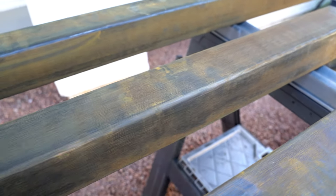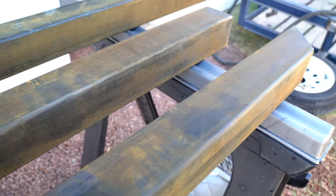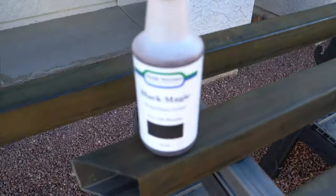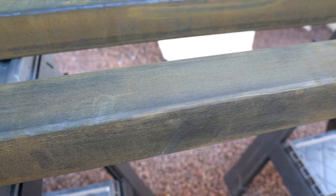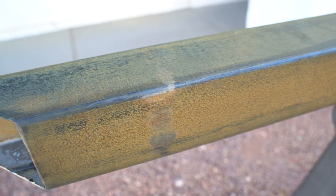The frame pieces are done drying in the sun and I am not happy with the finish at all. And let me be clear — I think the product is doing what it's supposed to be doing and doing it very well. My issues I think all stem from my lack of knowledge and experience applying this stuff. First of all, I don't like the rust color. It's kind of cool looking but it's not what I'm going for. This is Sculpt Nouveau Black Magic — it's supposed to be black and it's not black. What I think that is, is surface rust from letting it dry naturally. If you've ever gotten bare metal wet, you'd know how quickly surface rust forms as the water dries. I think drying with a towel will help quite a bit, and I'll be adding a clear coat later, which I really think is going to bring out the black. Some other issues I have are splotchiness where the pieces were sitting on the sawhorses.